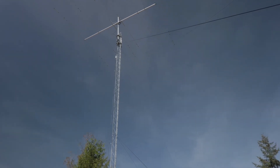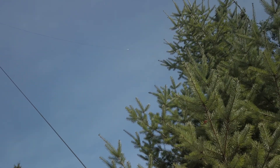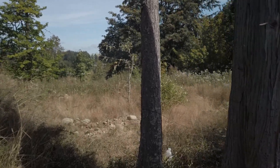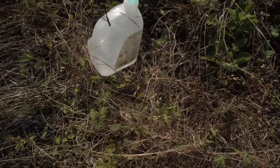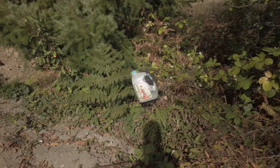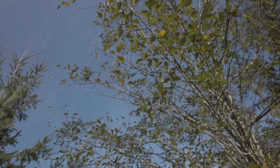It's connected to the bottom, and then this sloping wire that you see right here with that insulator — that is my 75 meter off-center dipole. This end is sloping because I have disconnected the counterweight. What I do is I use a jug filled with water to weight it down. I've disconnected it from where it normally goes on the wire just so it doesn't slide all the way through the trees. Here's the jug on the other side already connected. This is what keeps the tension on the 75 meter off-center dipole.